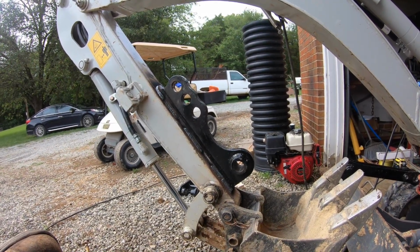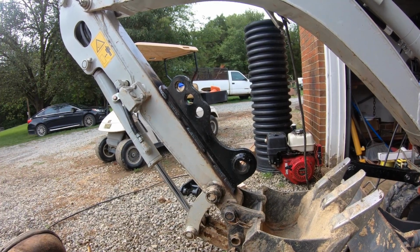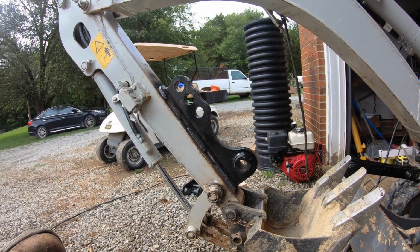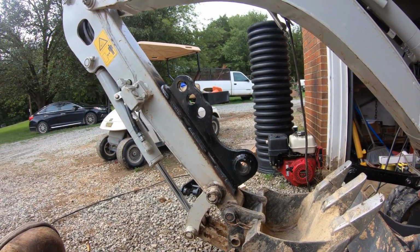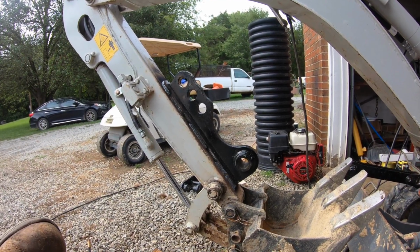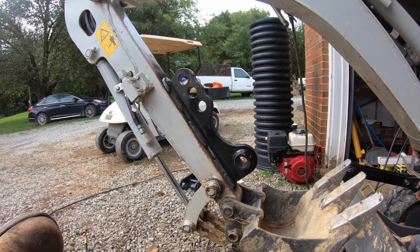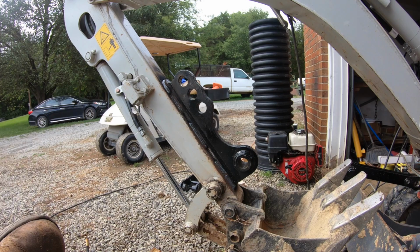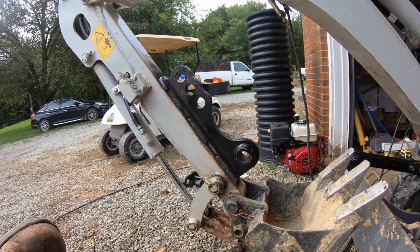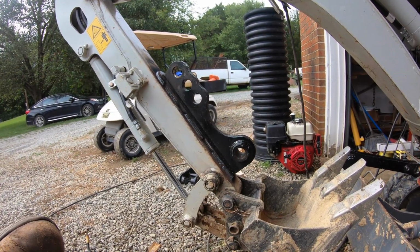As far as pulling it, lifting it, that's not a problem with this tractor. It's not a problem at all. But when you get that thing stretched out, what's hard on it is when you turn that thing around and you stop, and all that extra weight's out there. It's like a little old tractor pulling a 2-foot bucket full of dirt. It's hard on that motor, pulling and stopping that turntable. A lot of people don't think about that stuff, but that's where the extra weight would be.